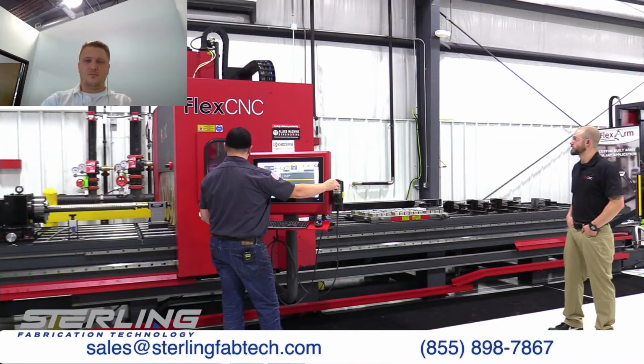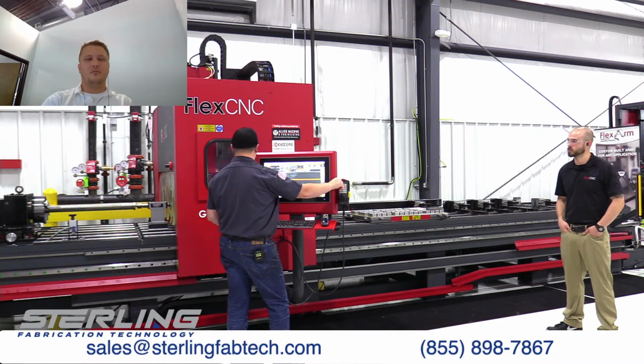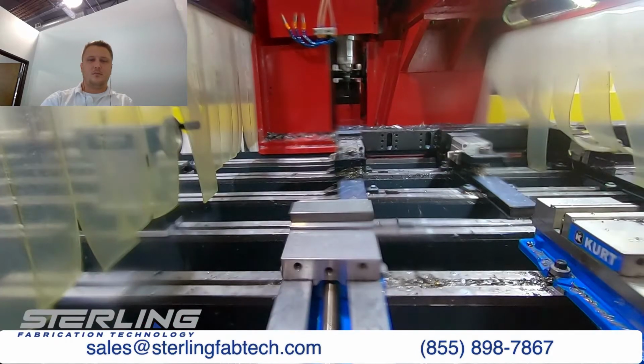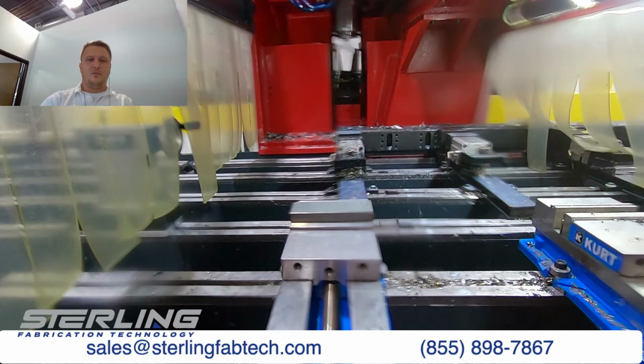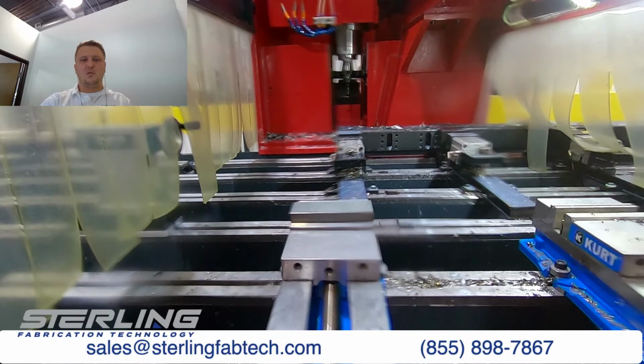There we go, man. Excited to see it. So the first tool that we're going to pull out here is a 27/64 mega muscle drill. Again, this is kind of like the same style drill that I ran on that 4th axis demo, just a little bit bigger. This would be the size drill that you would use for a 1/2-13 drilled hole, or tapped hole, I'm sorry.